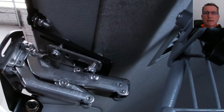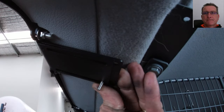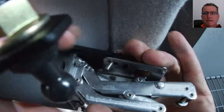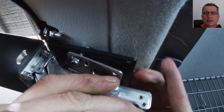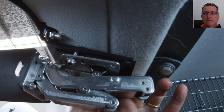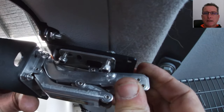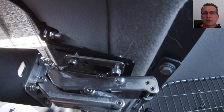Now we've got the four bolts in on the hinge, we can move to the back hinge — same process again. We've got two bolts through into the front of the hinge; there's a bit more room towards the back of that bracket. Once everyone's done we can move the hinge forward, which allows us to get the back bolts in. Pretty fiddly getting in that little space. Moving the hinge back up into place — when placing these hinges, generally go for about 8mm. Keep the hinge protruded about 8mm from the frame. Now we can tighten up those support bracket bolts.